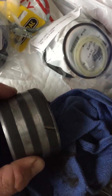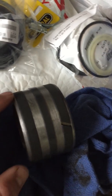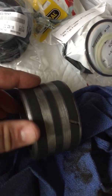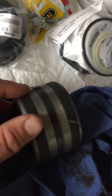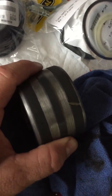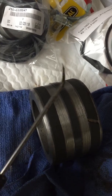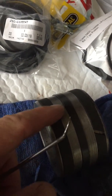So what you have to do is once you put your rubber seal in here, you have to slide this over carefully and not tear it up. It has a beveled edge right here which makes it a little bit easier to slide over. I used a straight pick and was real careful getting it on there.